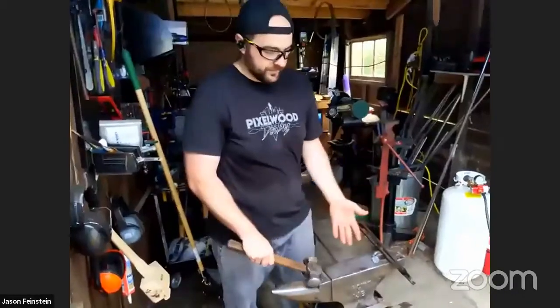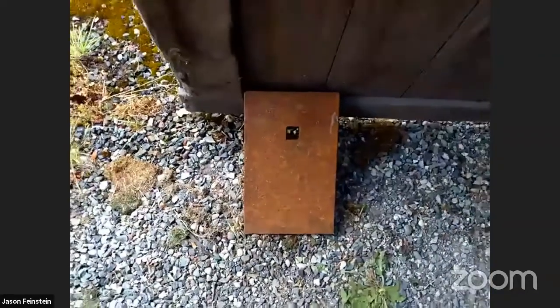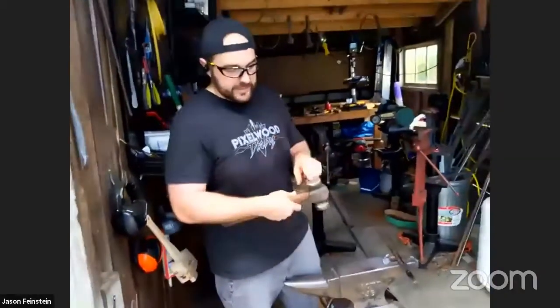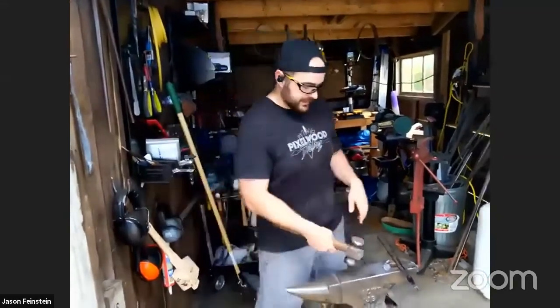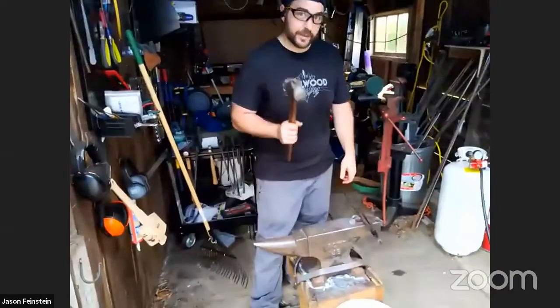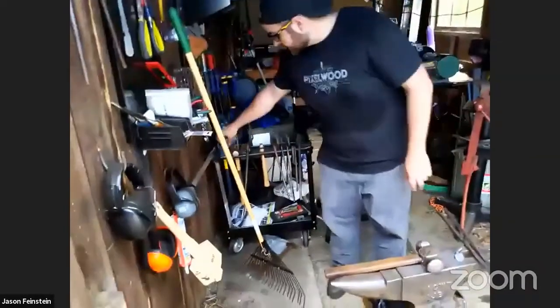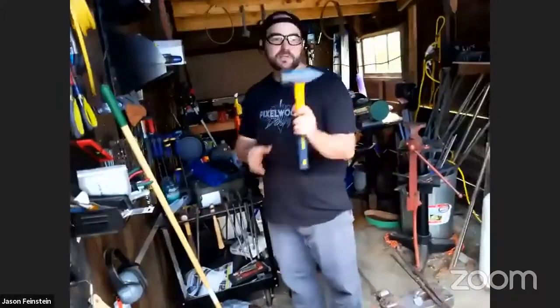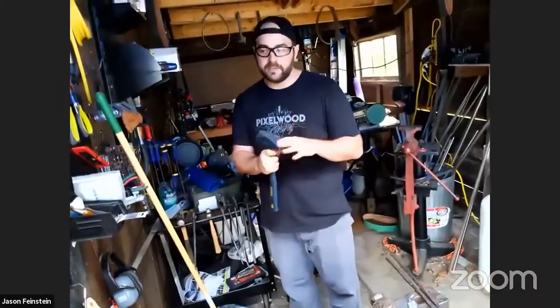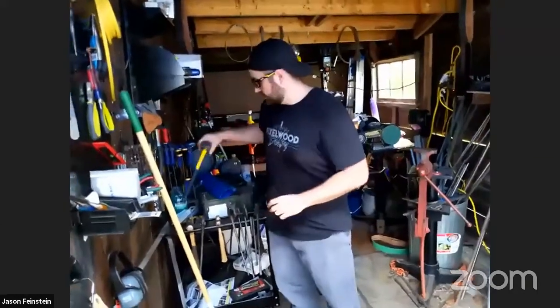and you don't have to have a real anvil. You can just have a heavy piece of metal, like a big piece of steel, and then a hammer. One thing I'd recommend though is a hammer that doesn't have the carpenter hammer claws, because if you're hitting something and it bounces back, you don't want those to hit you. You can find hammers like this at most hardware stores. At least this isn't going to hurt you if it comes back and hits you, but the carpentry hammers that have the claws could be a bit dangerous.